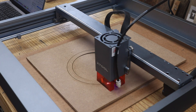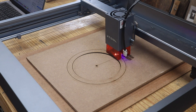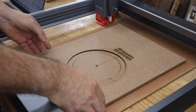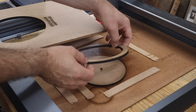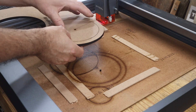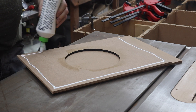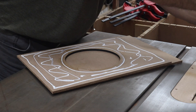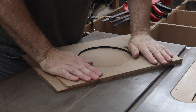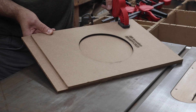I lifted the 6mm MDF off the surface by about 3mm with a few spacers and ran the program again — this time it cuts through successfully. I also added some engraved text to identify the template and alignment lines from the center to the outside of the circles to align the pieces once cut out. The XTool D1 Pro 20W is really an amazing machine and can easily cut through 9mm MDF in two passes when set up correctly. If you're considering getting this laser machine, definitely also consider getting the honeycomb panel set to rest your material on. XTool runs many special deals throughout the year and I'll leave a link in the description below.